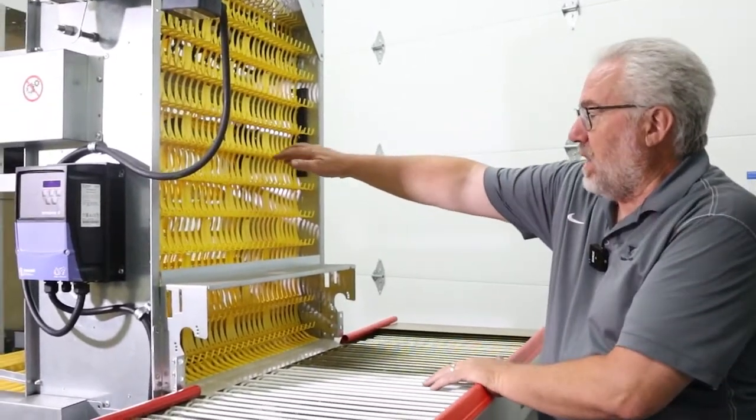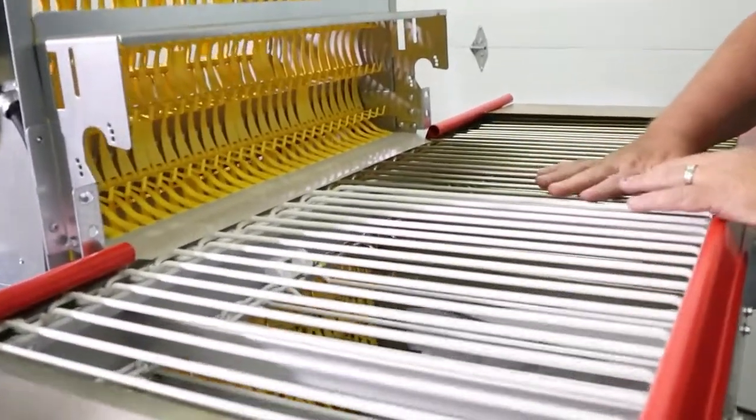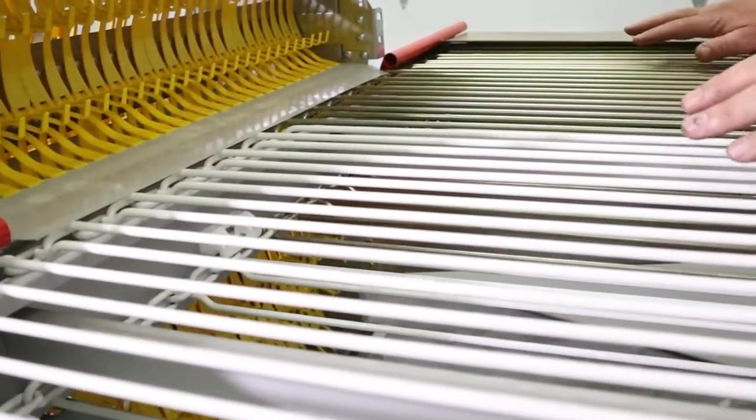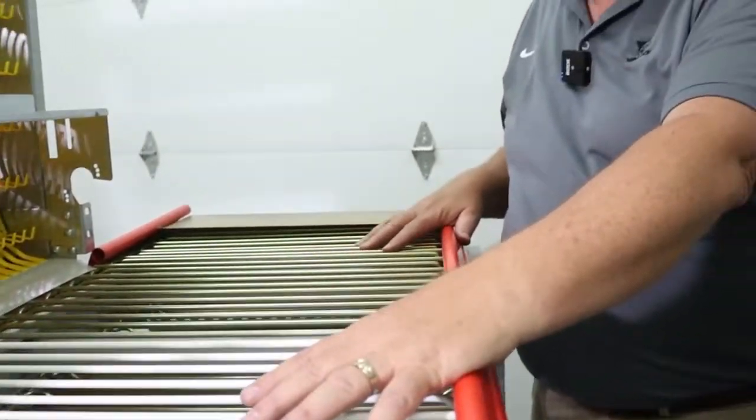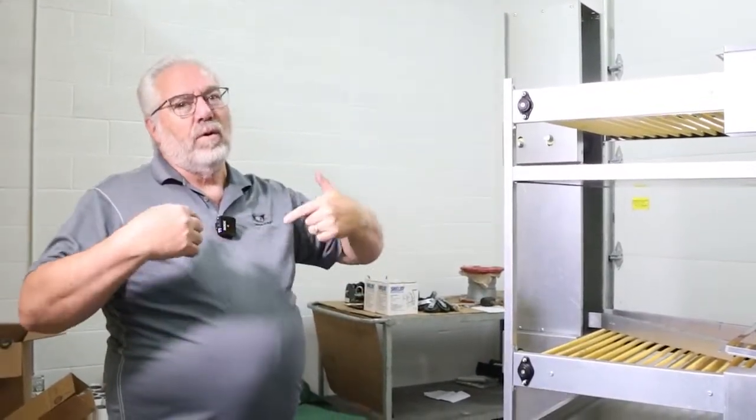The fingers carry the egg down and they come off on the transfer plate onto your cross collection, either to your packer or your processing machine in the plant. In addition to the collector, we have manure drives at the back of the house to run the belts. These are specially designed to keep the belt centered, and we have very little problem with belts moving sideways or losing grip. We use one direct drive motor for every belt.